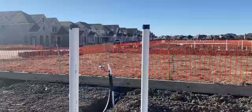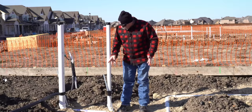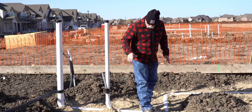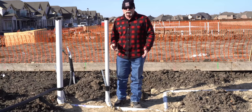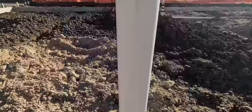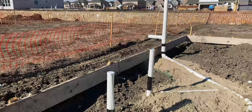Some more lines here — these probably go upstairs. One could be stubbed up to catch a washing machine or washer box; the other probably goes all the way upstairs to catch the upstairs bathrooms. Without looking at the drawing I can't say for certain, but you can tell by looking — everything is primed and holding. They've got conduit in to help hold things straight, sand is packed really well around everything, lines don't move when you stand on them. Now we're probably in the master bath — I've got a toilet right here with a 4x3 90, and a branch line coming off that can serve as a vent or catch a lavatory.